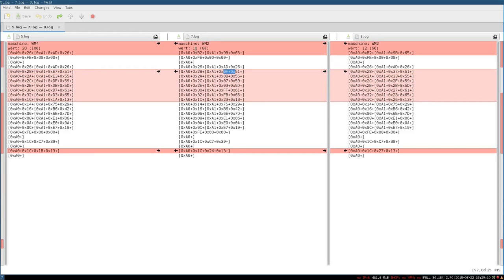We can also confirm it by looking at this result. Here we've decremented the value by 4 points, and we can see that it's gone from E751 to 0F51. The 51 didn't change. If we decrement again by 4 points, the 51 didn't change. Only the first byte changed. So here we see again that the first byte is the smaller value. It's encoded in little endian.